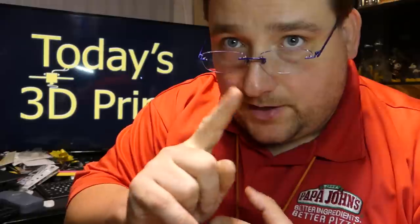Failed. And I got like two more that I can't find. Failed. This is where print settings come into play. Now, if you've been watching my videos, you kind of have an idea of what my print settings are. For the Ender 2, I use 5mm retract, negative 0.45mm restart, 0.2mm coast. Remember that negative 0.45mm restart. That's going to come into play pretty soon.